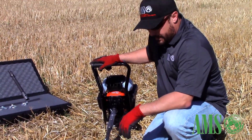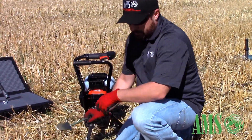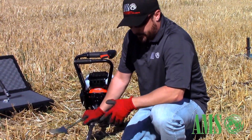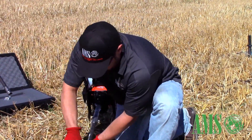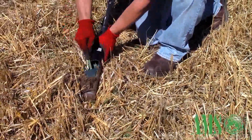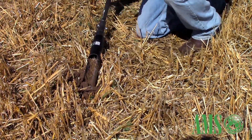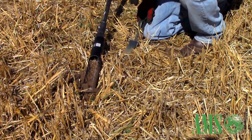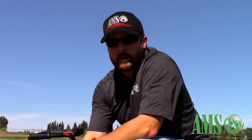The portability of a gas drill is unmatched, so in these soil conditions we're able to use this drill. In frozen soil, we recommend that you do run a rotary hammer drill. This Idaho spoon is very handy for ejecting your sample. And that is your frozen soil auger kit. My name is Harry Anestos and I invite you to contact me anytime if you have any questions regarding this kit, or you may contact any of my colleagues at AMS anytime. Thank you.